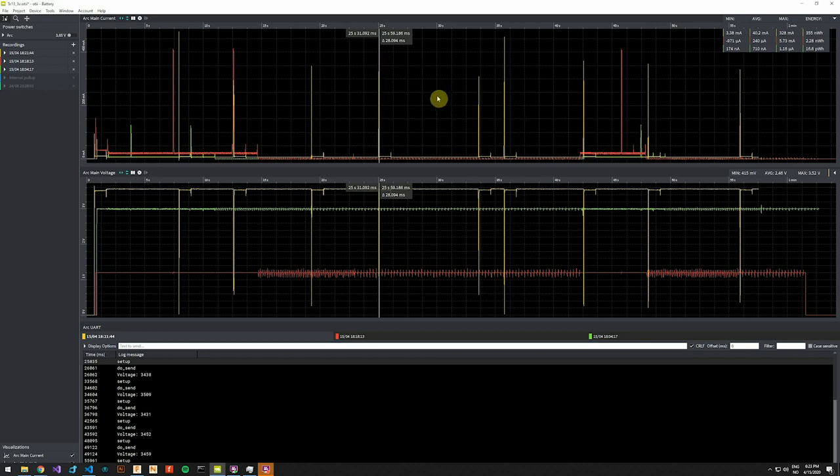To use coin cell batteries, you have to take a different approach, where you might have to make some kind of buffer with a capacitor or something like that. Your code also needs to respect pulsing, so that you don't make the device do its work as quickly as possible. You might have to insert pauses to let the battery regain its voltage.